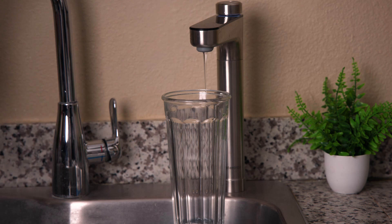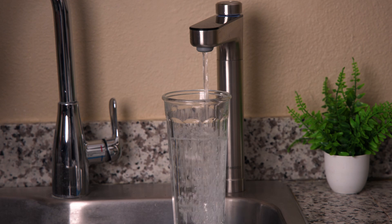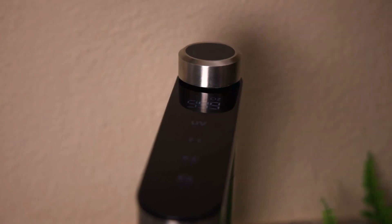If you insist on filling small containers, you could activate faucet mode, which alters faucet flow speed so there's a nice ramp-up to the pour. The downside to faucet mode is there is also a ramp-down at the end of dispensing, whereas in standard mode the water cleanly shuts off. Also in faucet mode, you can't connect your refrigerator or ice maker to the X12, and activating the mode first requires you to turn the system off and on again, so you can't jump back and forth between modes. There's also an energy saving mode, which reduces electricity consumption and pump noise, though the noise didn't even bother us in regular mode — and energy saving mode means somewhat slower filtration.